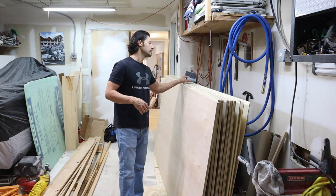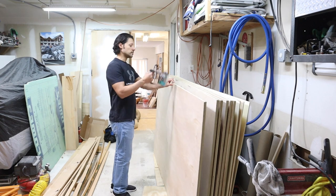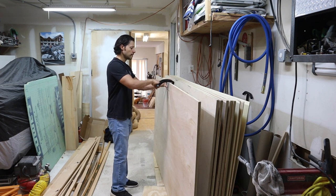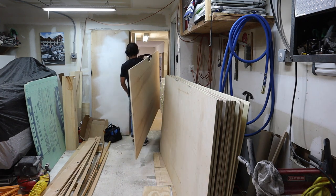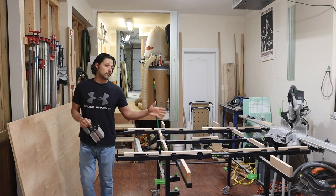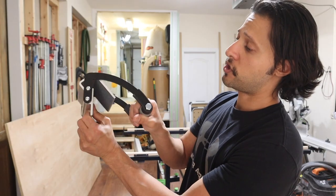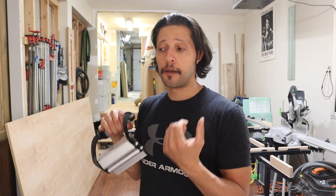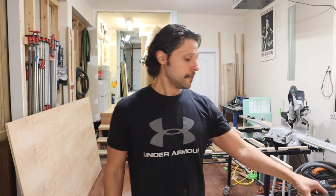Since I work by myself, I recommend buying one of these — a plywood gripper. All you have to do is place it about in the middle of the plywood, and as you lift the handle it cantilevers the whole thing to grip the back of the plywood. You just get under it, stand straight up, and walk away with the plywood. It works on a leverage principle — this squeezes onto the plywood and as you lift it, it pinches together, allowing you to use your body mechanics to lift the plywood with ease. Each sheet weighs about 50 pounds, so when you're by yourself it gets a little daunting. I'll link that in the description.